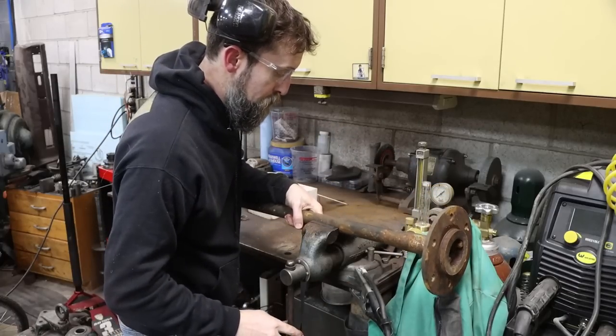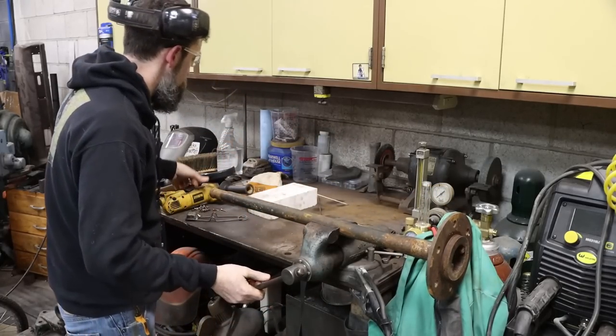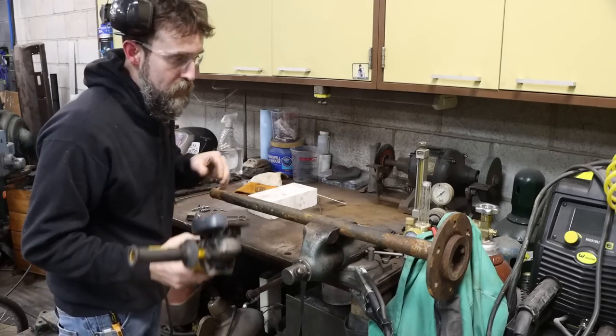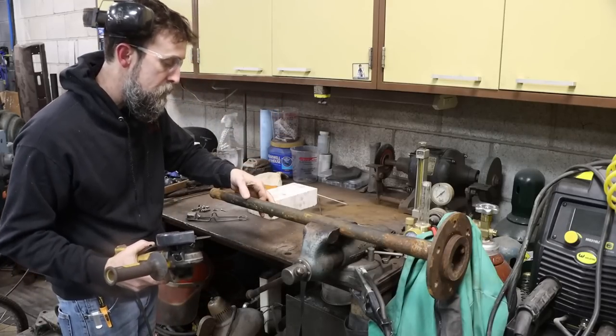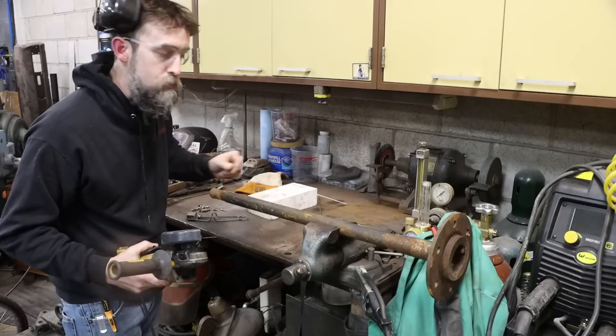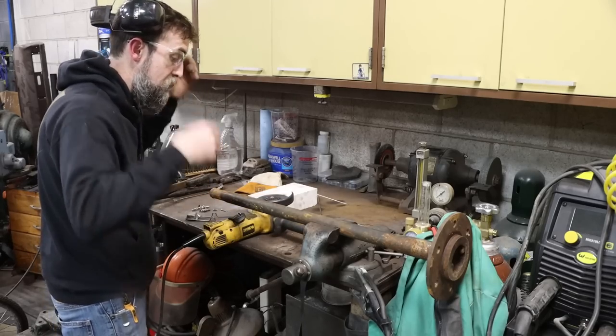So because of this axle's hardness, we have to cut it in its hardened state with an abrasive wheel. If you was to stick this in your bandsaw, it just smoked the blade immediately. So we need to get us off a chunk, soften it up, that way we can use it just like any other steel that we would get that was in an annealed state.